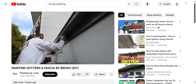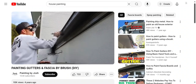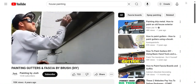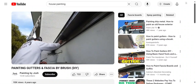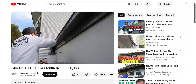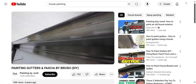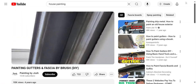Lay it off in one nice stroke in the same direction as your gutter, then just blend it in and lay it off. See how the bottom hasn't dried yet — you can maintain a nice beautiful wet edge the whole way along. As you can see, I've got a nice finish between my gutter and my fascia, and nothing's dried out.